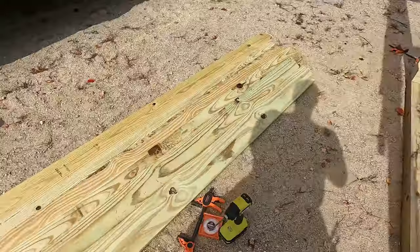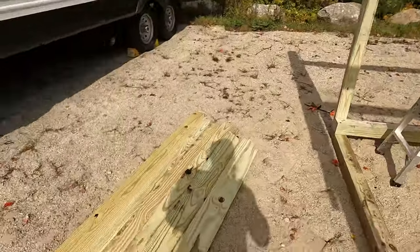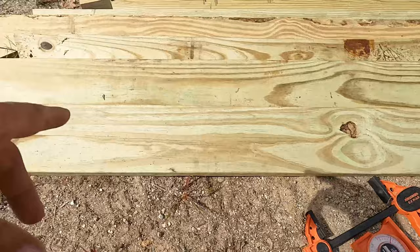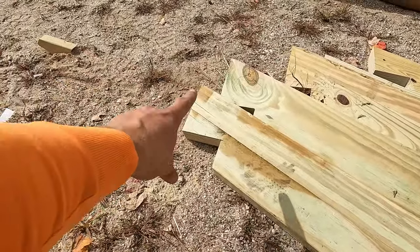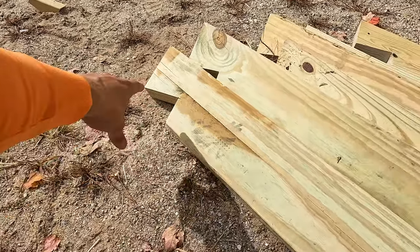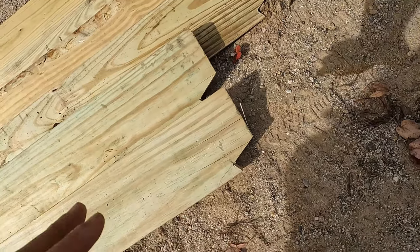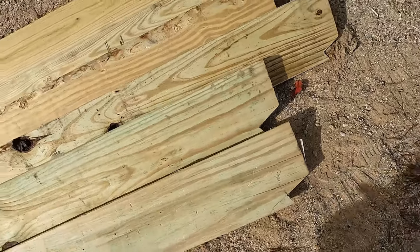When I laid it out, I just propped up the board and traced where my notches are gonna be. It turns out using this gauge it's a 4:12 slope, which is more than enough for this metal roof. I transfer the 4:12 to make a plumb front cut and then our seat cuts — front right there, and then back. These are not cut to that angle but it doesn't really matter for the back. We're doing 16 on center.